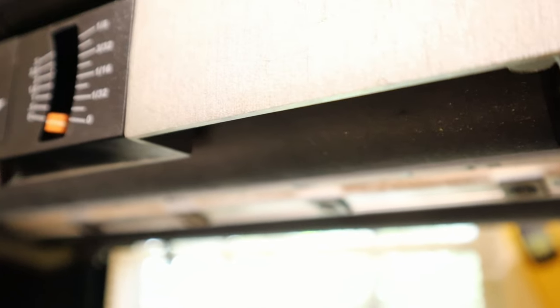Just wanted to show you the roller setup. Take a look here, and you can see these rollers are really close to the front of the planer. My guess is that has a lot to do with the way the planer engages the wood so smoothly, because there's a good amount of distance between the roller and the actual cutter head. And usually that's the reverse.